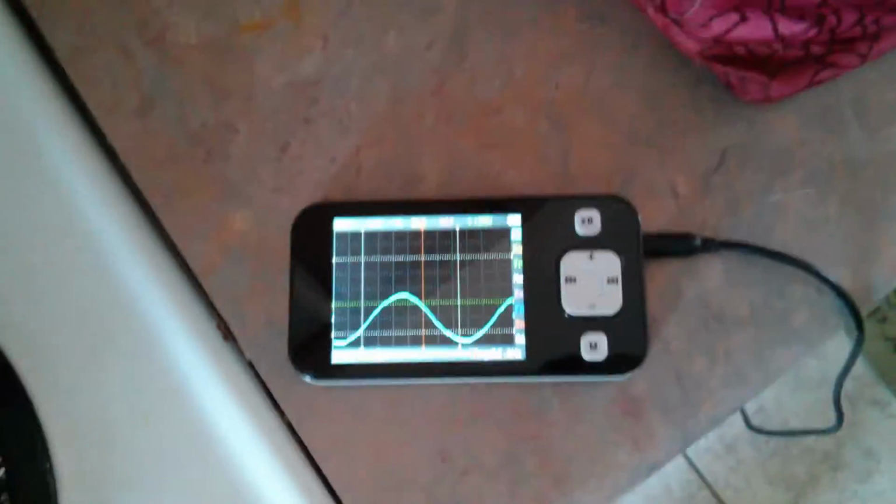Okay, so now we can go back upstairs, get my oscilloscope, and let's see what happens to the sine wave when I turn the furnace on. Because I know I should be able to run the furnace. All it is a fan. It's a gas furnace, so it should be okay. Yep, there's a sine wave. It's all good again.